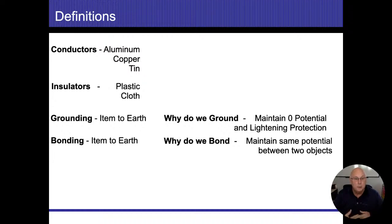Because of that, there were fires that happened in homes, and the fire investigations during their cause and origin have determined that it was because of the aluminum wiring that was in the house. They brought that to Underwriters Laboratory and a few other places where they did the testing, and then they started making changes into not allowing single-stranded aluminum or solid aluminum to be installed in any sort of houses.